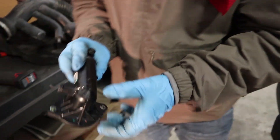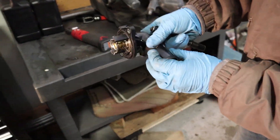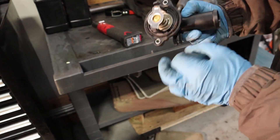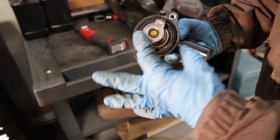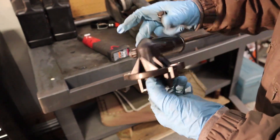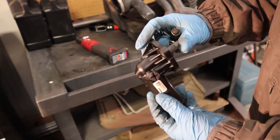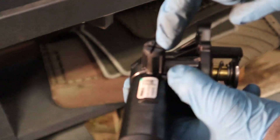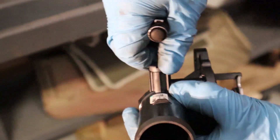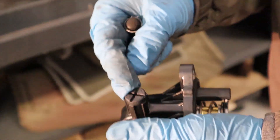I want to show you the new part right here. See how it comes — it's the whole housing, it's got a gasket right here, the thermostat incorporated, and the plastic housing itself. Now this valve that you see right here is so that once you put the new thermostat in, you can open this valve and bleed the air out of the system.